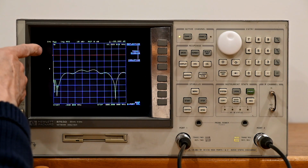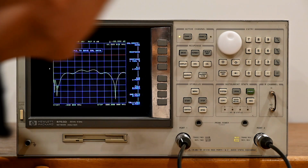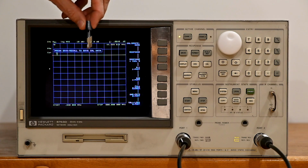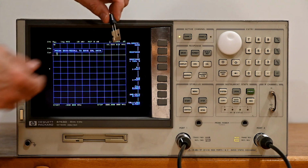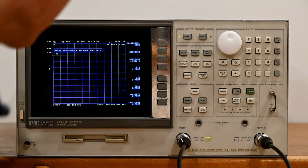The blinking that you see on screen, it should not blink. The reason it blinks is because the software was updated, but the power supply was not modified. This is the capacitor that you need to modify the power supply. It requires some disassembly. That has not been done yet. If that blinking bothers you, you can put in this capacitor and that blinking will go away.